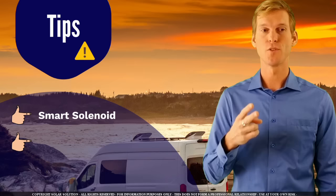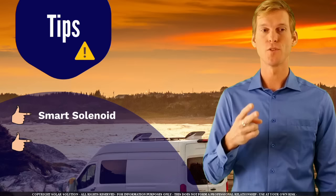The second tip is to match your battery types — if you want flooded, do it for both battery banks; if you choose AGM or gel, do it for both, and if possible go for the same type and manufacturer. The last tip is that if you choose flooded lead acid batteries for your house battery bank, always keep in mind that these batteries can and will produce acid gases, so make sure you always ventilate the area around your batteries.